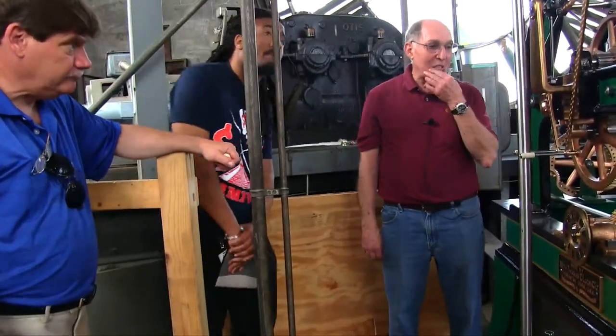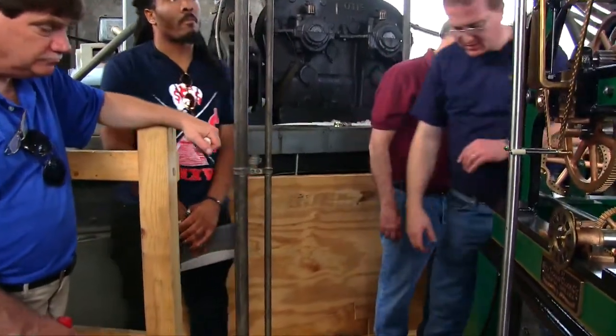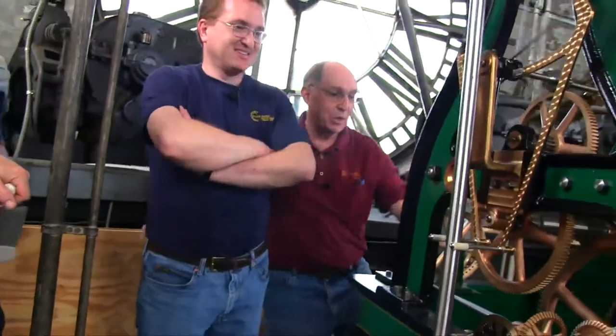The clock is wrong — shall we set it? Right here, there's a worm gear mounted on the side, and on the ends of it the shafts stick out with a pin through it, and there's a little dial indicator on there. You've got a T-wrench that has a hole and a little slot cut in it — that fits on either end, whichever one you can get to at the time, because this is rotating all the time.